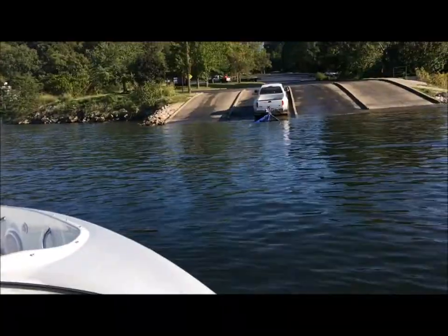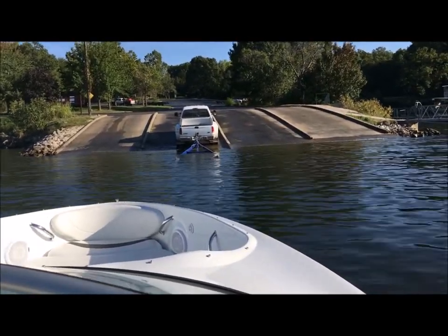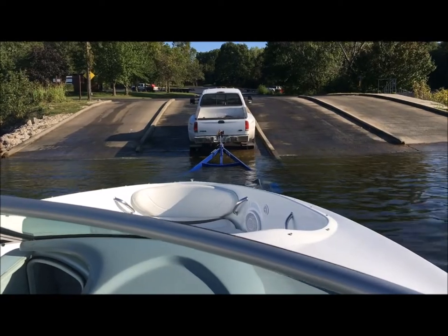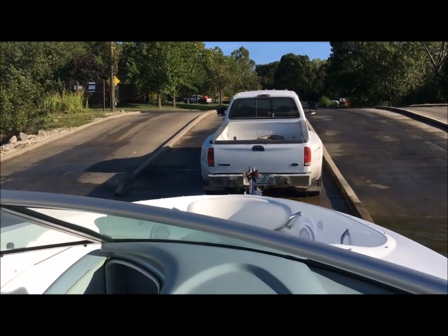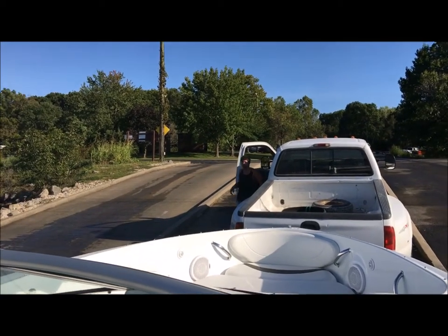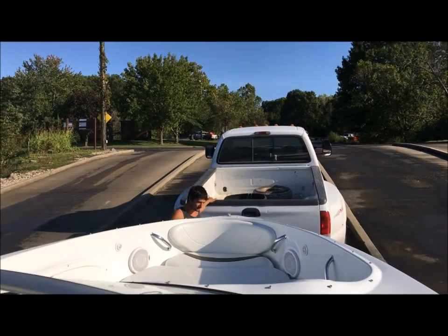Appreciate the opportunity. Getting ready to put it on the trailer now — this is where people struggle sometimes. They get the trailer too far in the water. You can barely see the front bunks out of the water — that's what you need. If the trailer is too deep in the water, the boat is floating on top and the trailer is down in, so you really don't know where you are. Get the boards out — this trailer is made specifically and only for this boat. Get those lined up and just drive right up. Then you get a good friend like Matt to come up and help tighten you up.